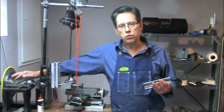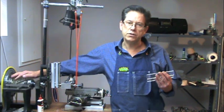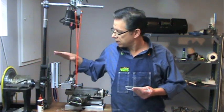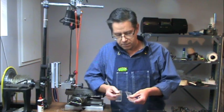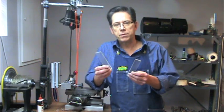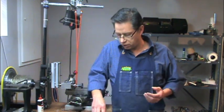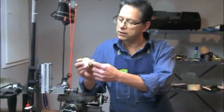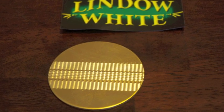Some designs are going to look aesthetically better than others. What I've done in the last few weeks is come up with a program to cut pattern bars. This is the first part of the program: use it to flute a 3/16" diameter end mill, make yourself a little fixture to hold the plexiglass in place, and make a test cut — a pattern bar on two pieces of plexiglass, a shown and an opposite. Then take it to the straight line and see if you get an aesthetically pleasing result. On this particular pattern bar, I cut it in some engraving brass and tried three different movements on my straight line machine, and all the patterns turned out aesthetically pleasing.